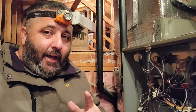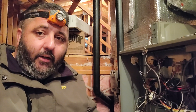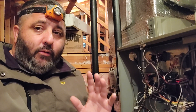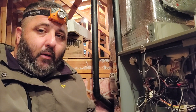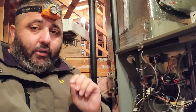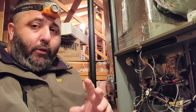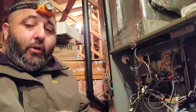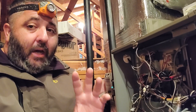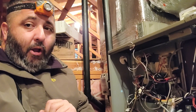Alright folks, thanks for watching Common Sense Fishing. Check out my other channel Common Sense Talks as well. This is one of my heating and air conditioning videos explaining how to replace a variable speed blower motor with a PSC blower motor — a permanent split capacitor, a simple regular blower motor. There are a lot of videos on YouTube showing how to replace an ECM blower motor with a PSC using a control board, a relay, or even two relays. I'm going to show you how to replace a variable speed, which is much different, and explain why you need to do it this way versus the other way.